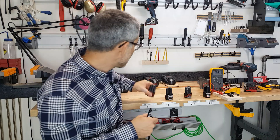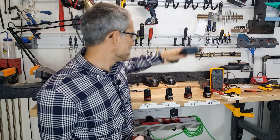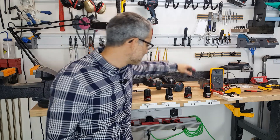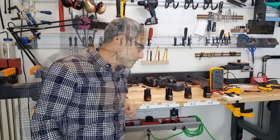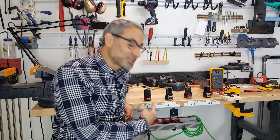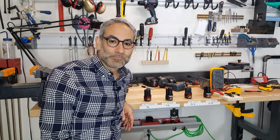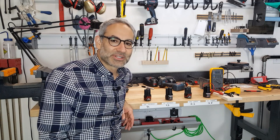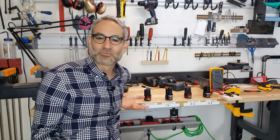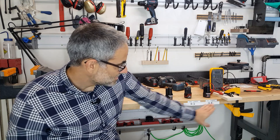These batteries you can see have a triangular pattern — there are three cells in it: one, two, three. If you look at an 18 volt Bosch battery pack, you can clearly see five cells. If you multiply 3.6 volts times 3 you do get 10.8. So Bosch was actually being honest when they came out with this system — what they meant was it's essentially that average power. A charged battery while running holds roughly 10.8 volts; the peak voltage you'll ever get from it is 12 something.